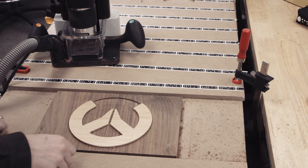For finish I'm trying some water-based spray-on poly. I'd never used it before but it came out fine. I ended up using four coats, sanding with 320 before the final coat. To hang the pieces I'll use some picture hangers I had laying around. I'll drill some pilot holes and screw them in.